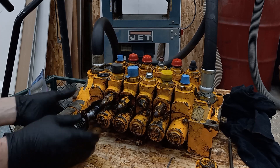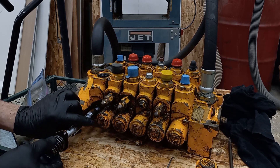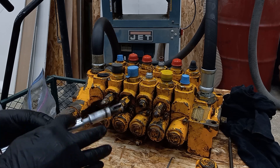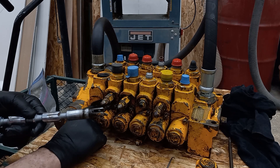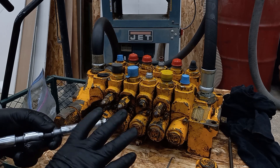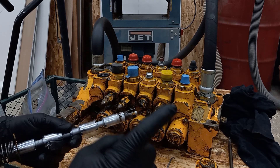You want to make sure that you don't scratch this surface — pull it as straight out as you can. And only take one of these apart at a time. This valve is lapped to this body, so if you take this valve out and put it in here, it may not seal. So it's very important to make sure that this valve stays with that body. Only do one valve at a time.